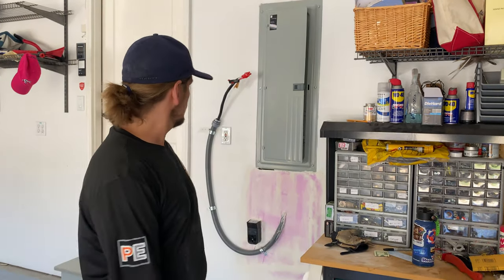It's not as easy as you think to turn your house into an electric gas station. Typically if you're at 125 amps, you'll be okay for Level 2 charging — assuming you charge at night. But in Colorado summers, seven or eight months out of the year, if your AC is competing with it, along with refrigerators or an attic fan, that adds up. If you're charging two cars, you'll likely have to stagger charging and swap them overnight.